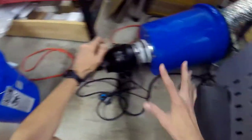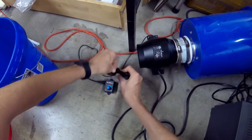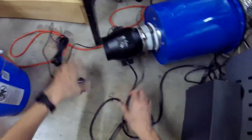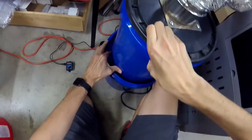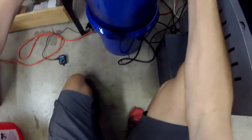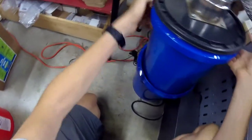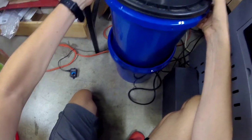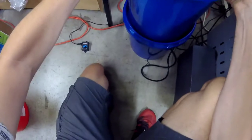The other thing I want to do is put this upright to make for a cleaner setup. The idea is to use another bucket to house the fan — the fan hidden inside the bucket. I'm going to design and print some clips that attach to the bottom bucket with a little L-shape to support the top bucket, and it's going to leave an air gap all the way around for the air to flow back out.